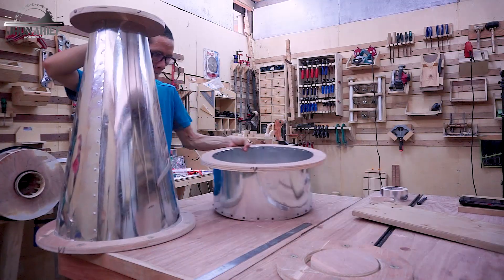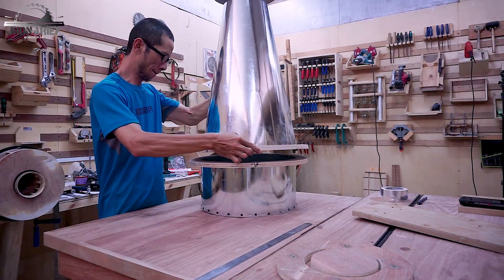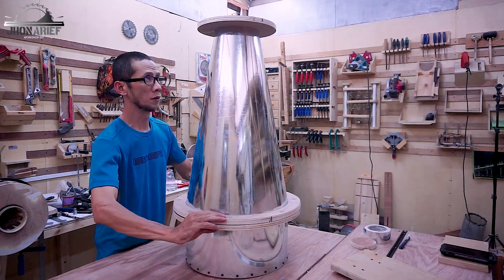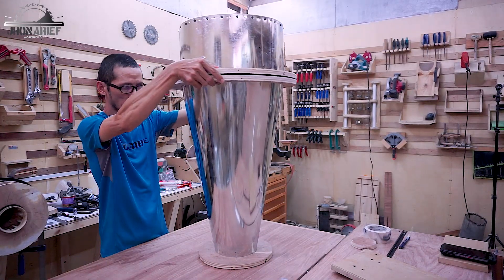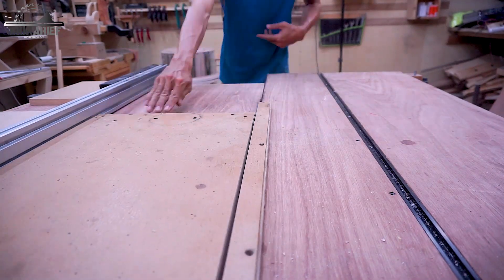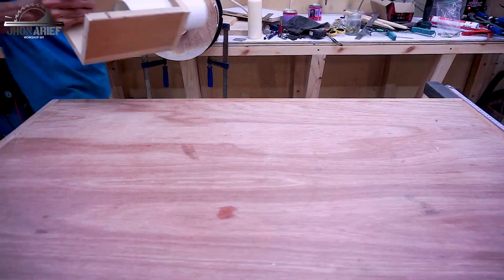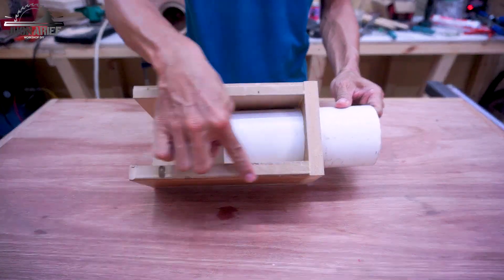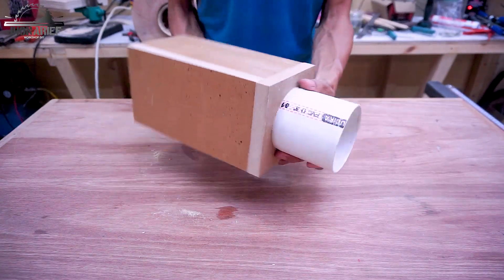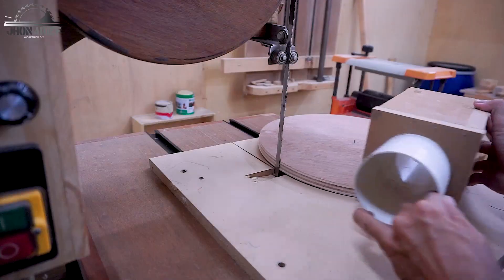It's going to be joined with the cyclone head. Now we have the structure for the cyclone, but it's not stopped here - the important part I haven't built yet. The next step is to build the cyclone intake. This is going to join with the pipe - I build this unfinished box and add this three inch pipe. The difference is the intake for the impeller is four inch, but the intake for the cyclone is three inch.